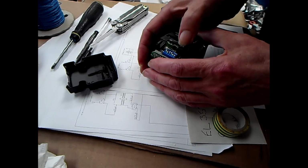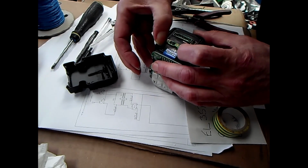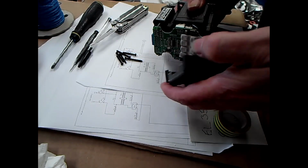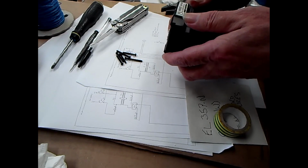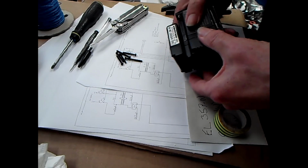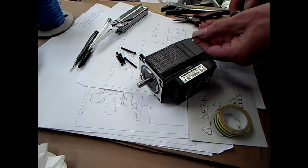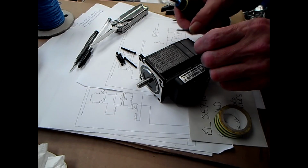The program can check during each cycle that these values are present in the RAM bytes that I've put them in, and if they are and uncorrupted, it means things are okay, or most likely okay. If the information in those bytes has changed for some reason, it's not supposed to change, so initiate a reset. If they are corrupted, a reset is triggered. Following recovery from a brownout, after resetting all essential stuff, if there's been a drop in power and the chip turns itself back on, these values are checked to see if they are intact and uncorrupted.